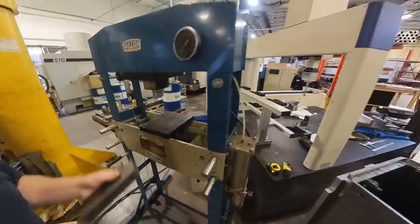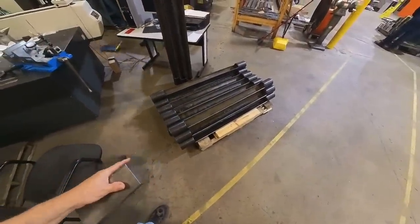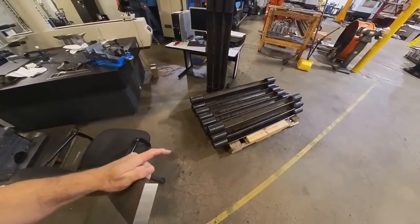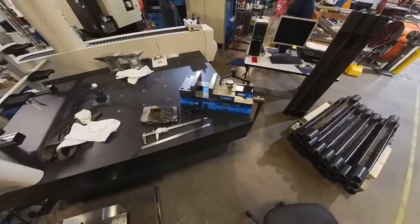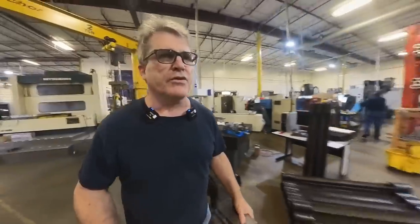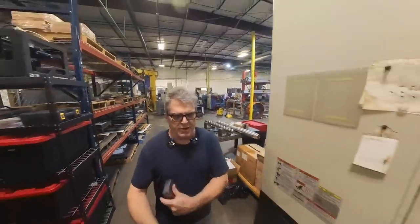What happens is when you cut that, well, I mill a track in the part so that it'll guide my plasma torch, and then I cut this material out of the tube, but when I cut it away, it springs open about 100 thousandths in the middle of the part there, so I have to squeeze the parts in something. And last time I did the job, I did it this way, but it's getting too difficult for me to crank that handle now after the truck accident and the messed up arm and everything.